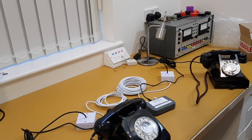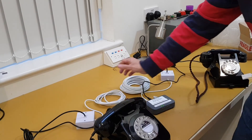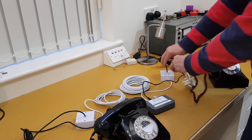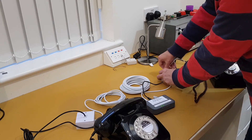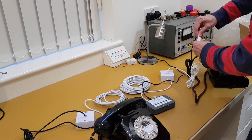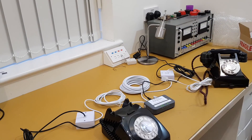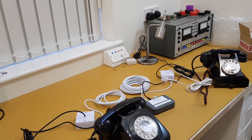If you need to extend the range beyond the included 12-metre and 3-metre leads, you can use extension leads of various lengths — up to 800 metres with decent quality cable. Simply plug your extension lead in and plug your phone into that. It'll work fine. The whole concept is standard components: no specialist wiring, no specialist electronics.